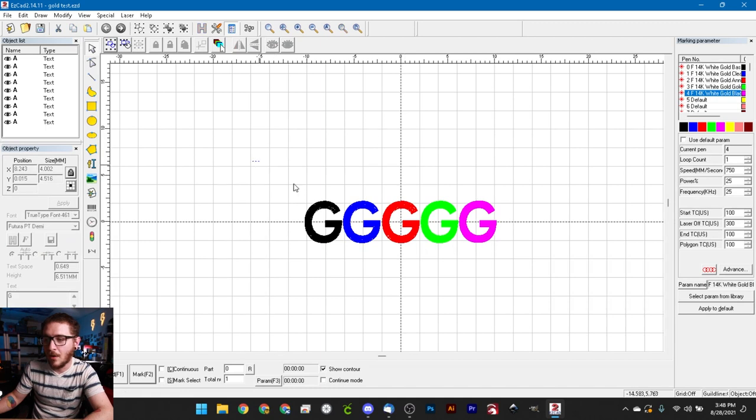So all we're going to do is take our test file here. We can run through the settings really quick. So let's take a look at our white gold base. We've got a speed of 500, a power of 40, a frequency of 25, all right? We've got our white gold cleanup, and that's going to be 750 speed, 25 power, 45 frequency.